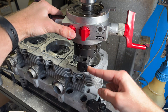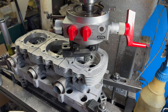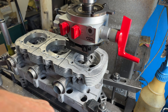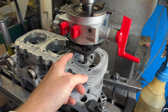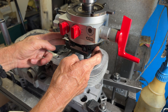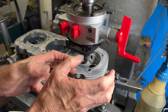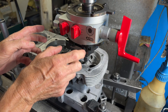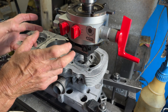We also have it set so that it will stop automatically as it goes out, just shy of the finish. The camera mount is on the table so the mill shakes quite a bit. The whole thing is offset, and because it's spinning at a pretty good rate even though I slowed it down, it creates an offset mass and you'll see it shake. Then it'll get very smooth when the mass is balanced in the middle of the cut, and as it continues it begins to shake again.